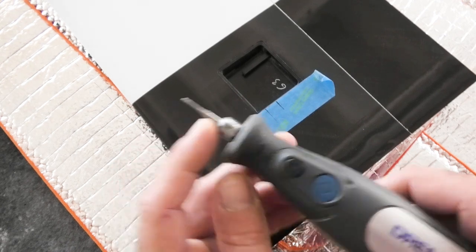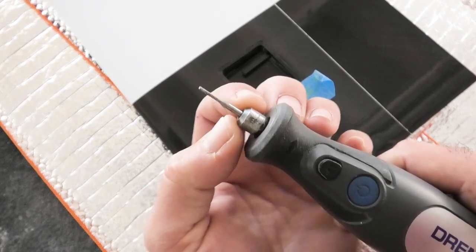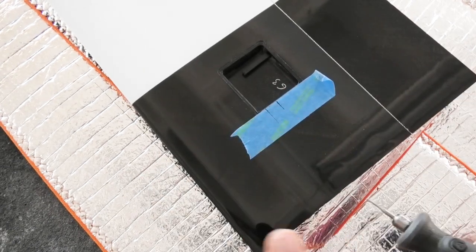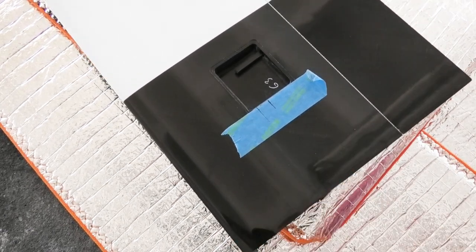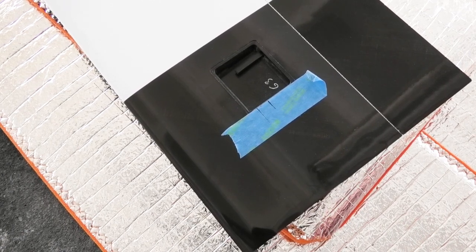And what I did there was once I got this started, I rested the shaft or the shank, the non-cutting portion, kind of in the pocket as a guide, and used the walls of the pocket to help me out.